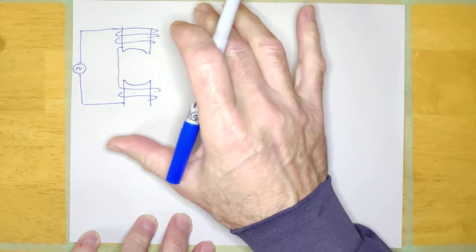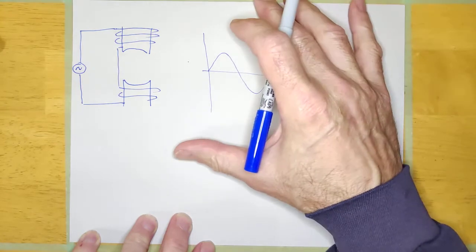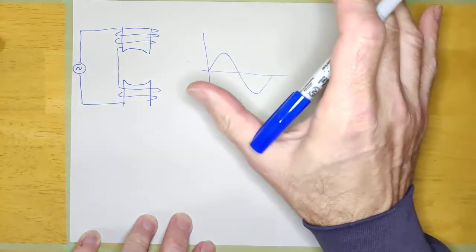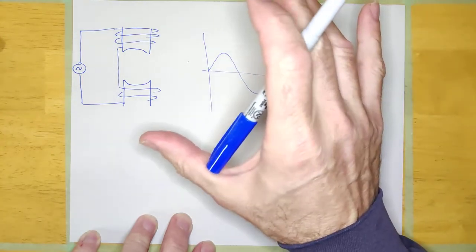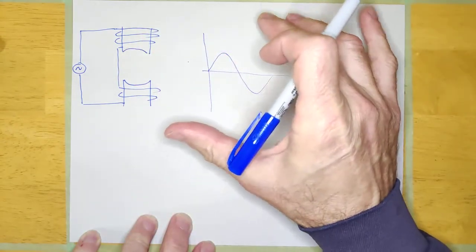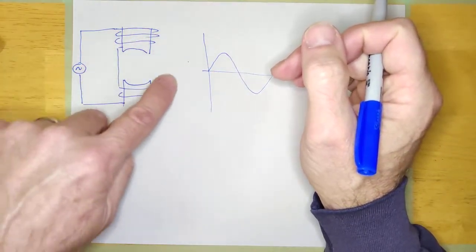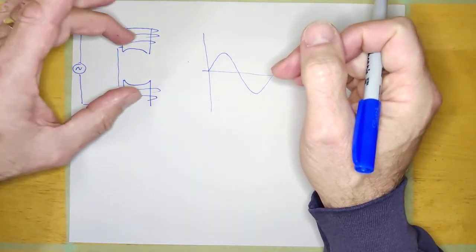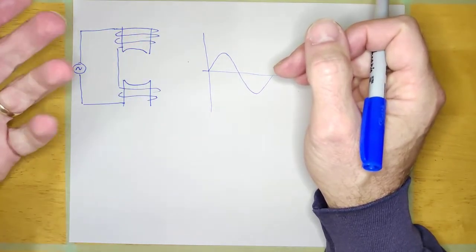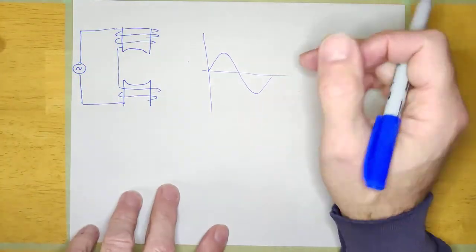Now, this isn't actually rotating — it's alternating. And that is a major problem for single-phase machines, which is why single-phase induction motors require a start winding. We'll talk about the start winding eventually, but for now I want you to believe that the alternating north-south magnetic pole is effectively rotating, because once you understand that, you can understand what's going on inside the motor.